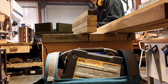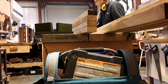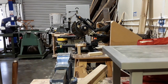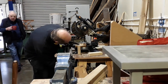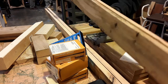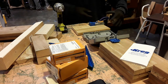And then the benches were starting to be assembled. I'd already ripped it to width. I'd changed the design slightly — originally I was going to go for a 90mm timber, but the stuff I found was about 140mm. And what that did was enable me to rip it lengthways into a 90mm and a piece that was just less than 50mm. And that gave me the downstands front and back. So for two lengths of the decking board, I could actually make a full length of bench.